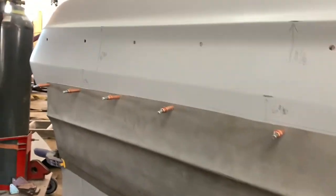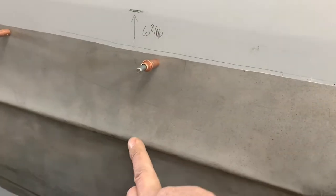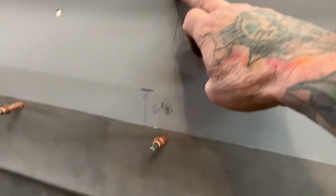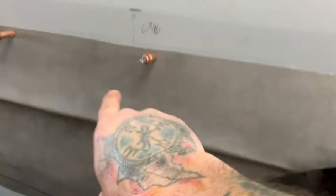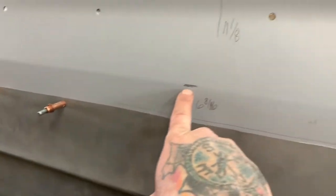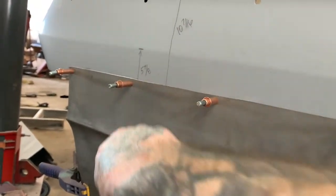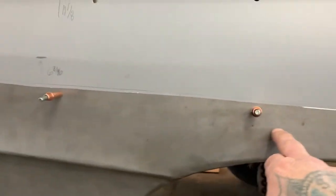This will be formed around on the bottom the correct way that the stock Plymouth Furies go. Anytime you're doing a quarter panel or a bottom quarter, you want to measure from a body line to a body line. I've got all my measurements right here — it's 11 and an eighth, then six, and from this faded body line right here down to here is six and three-sixteenths, ten-sixteenths, five and seven-eighths.